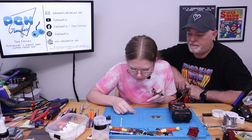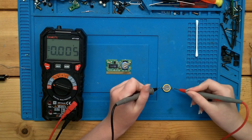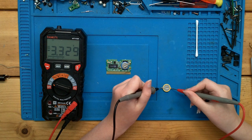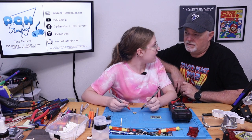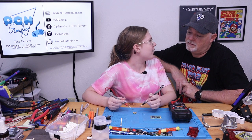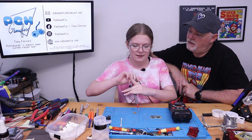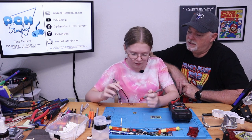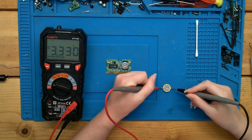So this is the plus side, I think? Mm-hmm. And then go. What do you got? 3.329, but it's minus. What does that tell you? That these are the wrong way. Right. So you have the positive lead on the negative side, and the negative lead on the positive side. So go ahead and check it again.